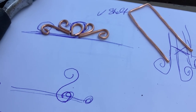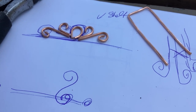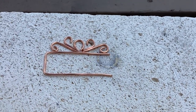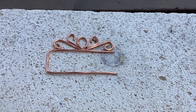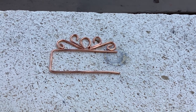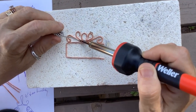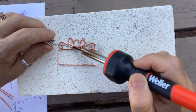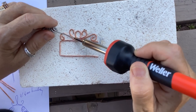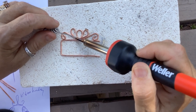You can see I did one side and then made the other side to mirror it — that was the idea. I've got it laying on the fireproof brick, which is where I'm going to do the soldering. Here's my first go at it: I applied flux to the metal and I'm using this tiny little soldering iron.